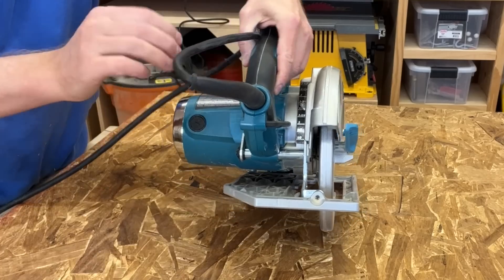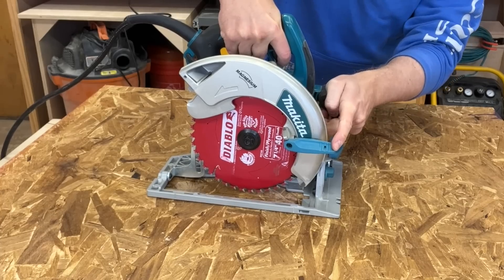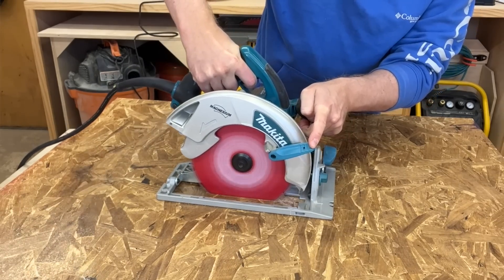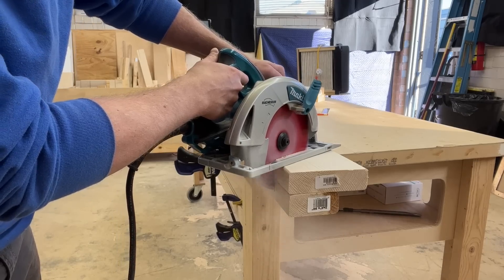In the loose plate technique, the operator will loosen the sole plate of the tool and let it swing free. They'll line the blade up with their cut mark, set the sole plate flat on the piece, and then lower or plunge the blade into the stock. I've actually seen a lot of pros use this method. They'll often even do it for edge cuts where they're gang cutting multiple pieces of stock, like making stair stringers. If pros want to do it, that's up to them. But DIYers and newcomers should really never do it.